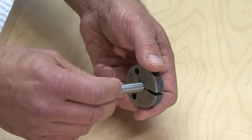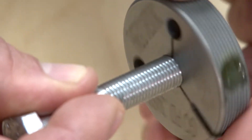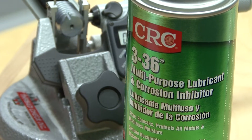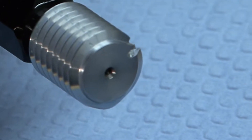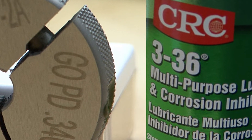Adjustable American gauge design thread ring gauges are designed with radial slots which form natural dirt grooves that tend to clean the threads of the workpiece. It is important to note that thread ring gauges should not be used as work dies. It is advisable to clean the workpiece prior to gauging, as this will extend the wear life of the thread ring gauges and prevent damage to the parts. Thread ring gauges should be cleaned with solvent or air and then frequently re-coated with a rust preventative.